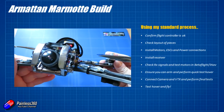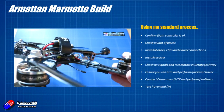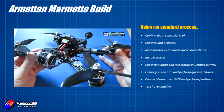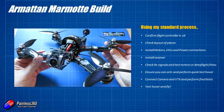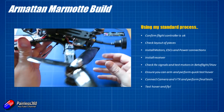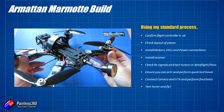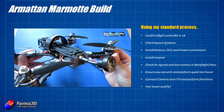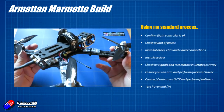I'm broadly going to follow these steps with only one small change. I'm going to install the receiver before I do the ESC and power connections, and that's for two reasons. First, I'm using a Crossfire Nano and one of the pads I need is underneath the flight controller, so I need to solder that wire up before I mount the flight controller. Secondly, I just wanted to check exactly how it's all going to go together. If you haven't used Crossfire with something like a CL Racing F4S — this is a version 1.5 flight controller — I'll show you how to wire that up and set that up too.